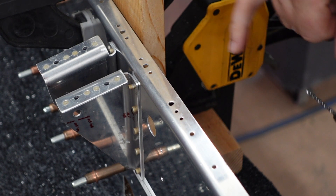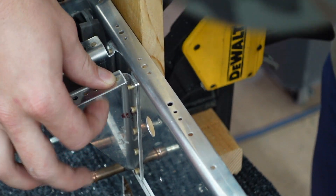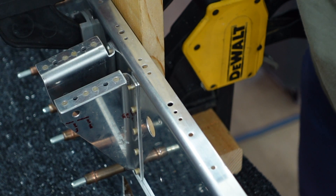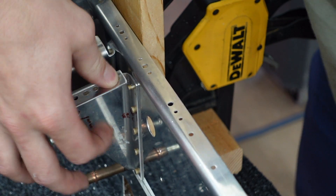I hope you can see on camera, but I'm not happy with how this rivet turned out. I've already started the process of drilling it out, which is why you'll see it's scuffed up. What happened is with these nut plates already in place, it's hard to get the bucking bar in there. So if I was to do this again, I would hold off on doing these nut plates and just do them after the fact — it's easy to get a squeezer in here and do them after. But the issue is the nut plate is pushing the bucking bar away.